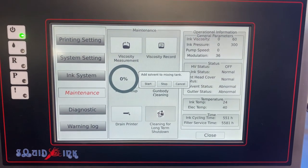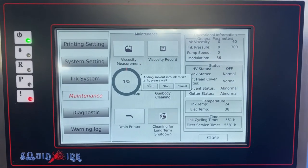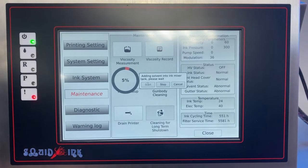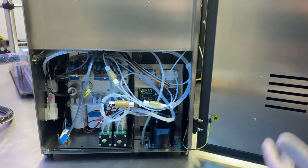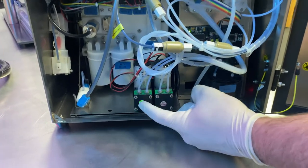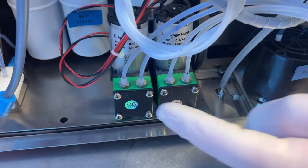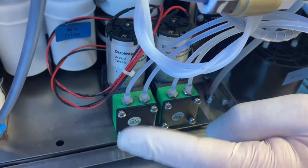When we click OK, the system is ready to add our makeup or solvent to the mix tank. Click start and just let it do its thing — this is going to take three to four minutes. It's just adding makeup to the mix tank and it'll tell us when it's done. While the system is adding makeup, you can come to the back of the machine for visual reference. Look at the pair of diaphragm pumps. The pump on the left is our ink transfer pump. You can see that now we've put a makeup cartridge in the ink cartridge slot, the ink pipes for this diaphragm pump are already clean — a good way to verify we're getting makeup from the cartridge through this pump and into the mix tank.